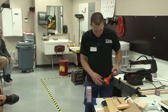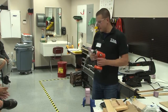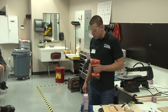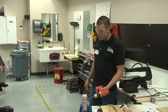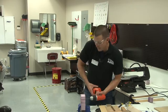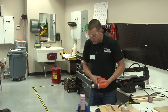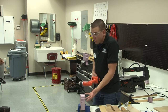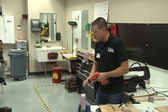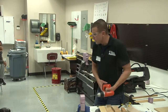Christina? Does the direction the drill thing is spinning affect the cut? Yeah, it's only shaped to cut clockwise. It won't cut counterclockwise. I've seen people try to make these holes bigger by taking their drill bit, and when they're drilling, going sideways and sideways and this way and that way, we just go straight in and out. You could do that with a piece of foam because it's soft, but if you do that with another piece of material, it's going to be bad for the drill bit, and the drill bit could get caught. So for all of our purposes, straight in and out.